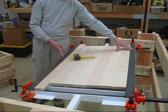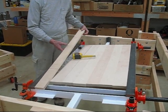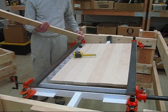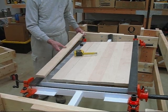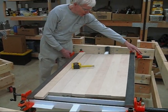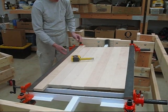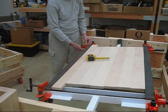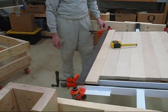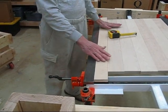So that's 24 inches. Subtract 24 from 26 and a half, and I get two and a half. So this piece I cut out of three-quarter inch plywood is two and a half inches wide. When I put this in and compress it with the horizontal clamps, I'll be extending the head piece so the clamp will be a half inch in front of the front edge, creating a force compressing the work piece.